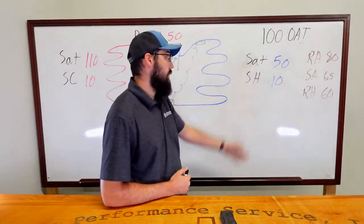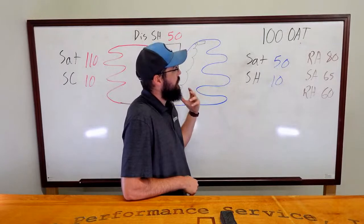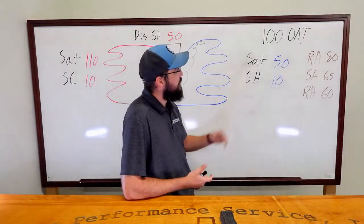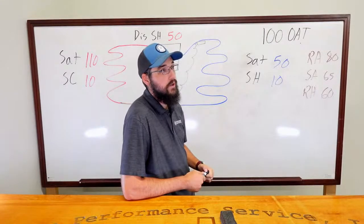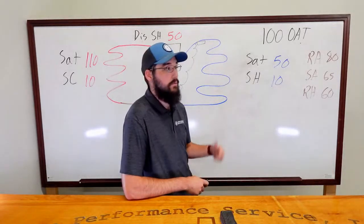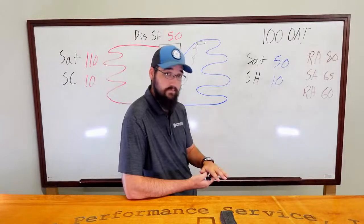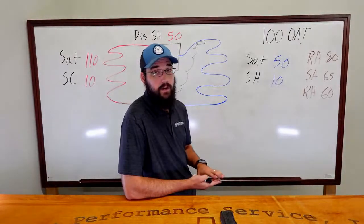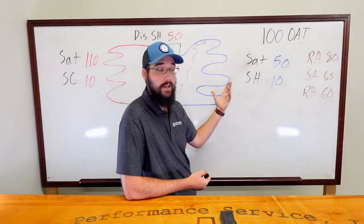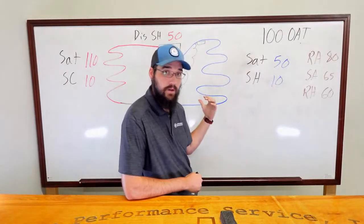But, you know, let's say that was true and it was a loss of oil in the basin of the compressor somehow, had oil somewhere in the system. But everything we see here, then you're diving into why are we either migrating or stacking oil somewhere else? Was the compressor flooding? That may be the other thing you don't know. The compressor was flooding for a long time and it wore down the bearings, it flushed the oil out of the compressor. Did a whole bunch of damage in the process. And by the time anybody knew what was going on and you get to it, this is the conditions you see. Because it can't compress and pump like it's supposed to anymore. So you're not going to have that same kind of superheat subcool issues you had prior.